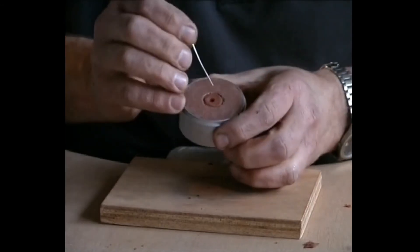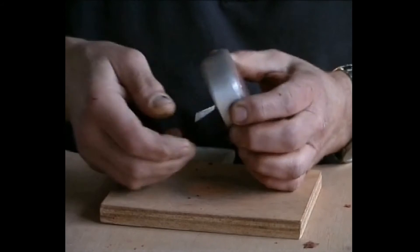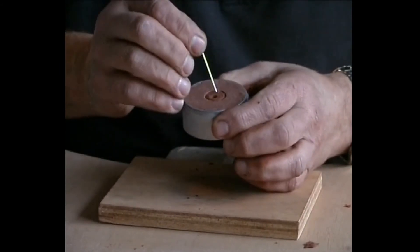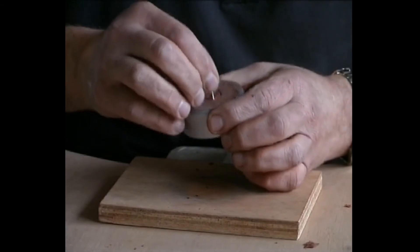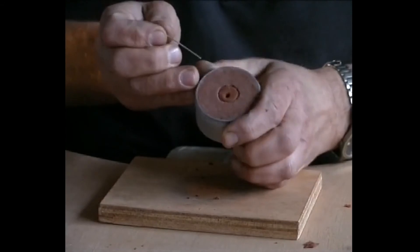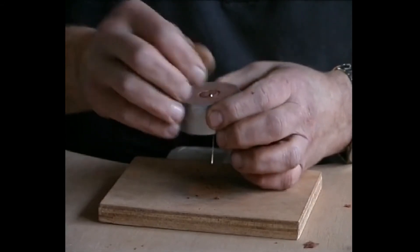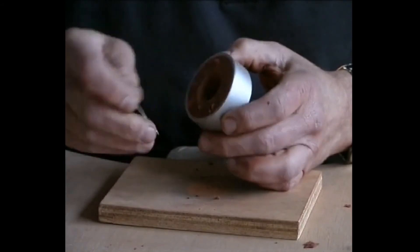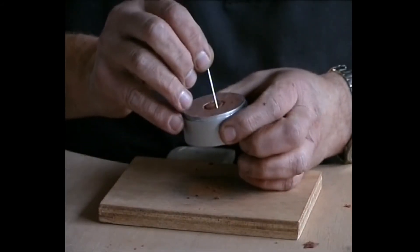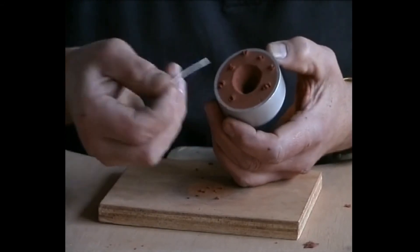When pouring, if the molten metal flows in at the middle of the mould, the air must leave at the sides of the model. We must therefore make several air vents at the edges. It is always better to make more small air vents than three or four larger ones. The reason for running the vents diagonally through the mould is to avoid entering the funnel. If this should happen, the molten metal will block off the air vents.